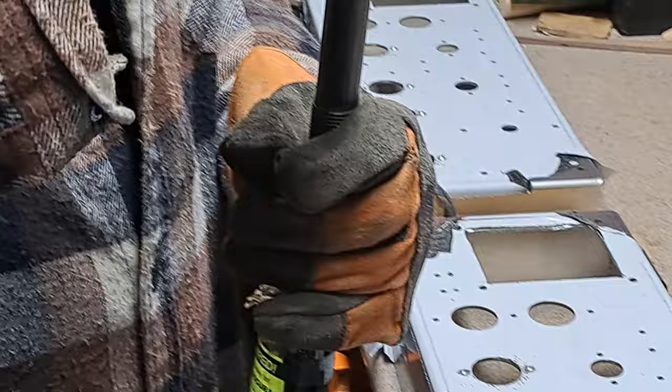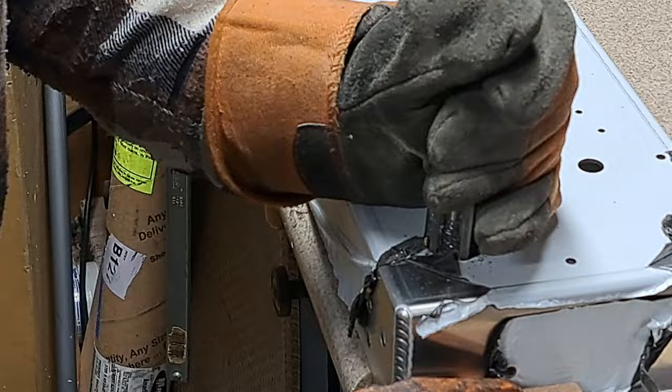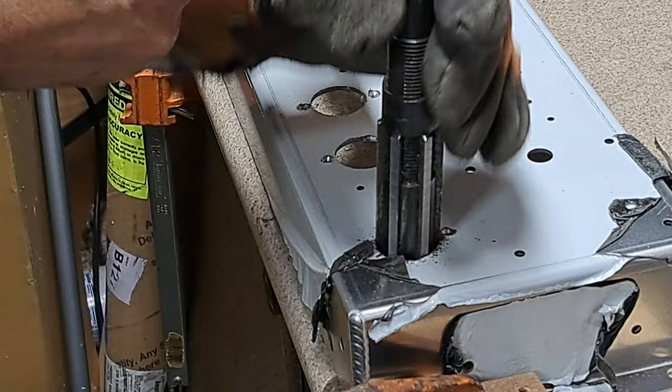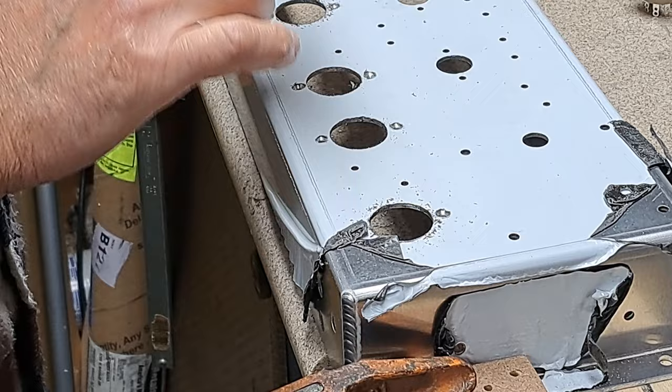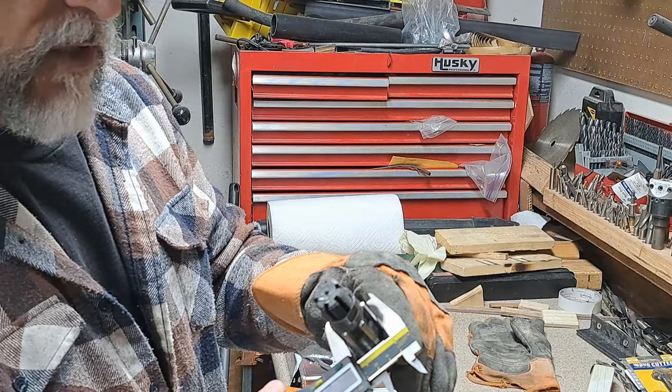Back on with the glove. Don't try to put an air tool on this — I've tried. It doesn't work. You've got to take very small bites and you will have a perfectly symmetrical hole. You've got to put pressure down on it. Usually your left hand is enough unless you're taking too much of a bite — if you're taking too much of a bite, you're not going to be able to get that to drop down in the hole. But it's basically a machinist's reamer, size-specific reamer. So that hole is that much bigger now, and I still got a mile to go before that fits in. I keep measuring that and I'm nowhere near close, but when I start getting close I'll measure, and I'll leave my thing set there.